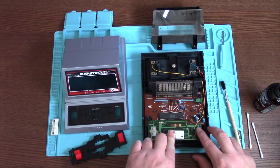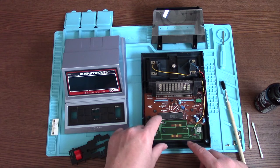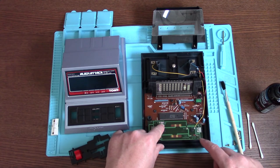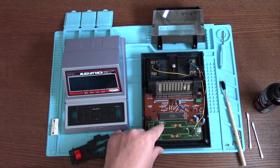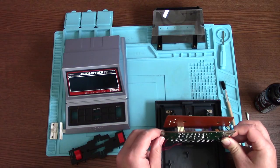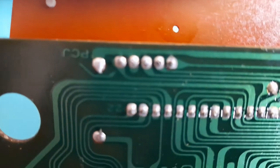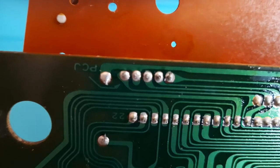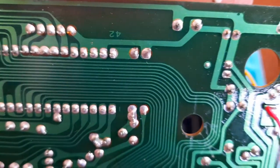It's quite simple really. We've got these two contacts and they seem to link to this cable here. The top of the start button goes to the second pin here, and the bottom looks like it goes around to the third pin. I wonder whether these solder joints are okay. Let's have a closer look at them. No, they're not. This is the other side of the solder joints and as you can see, this one is definitely cracked. They all look a bit dodgy. So I'm going to re-flow them and add a little tiny bit more solder.